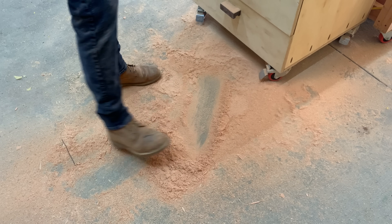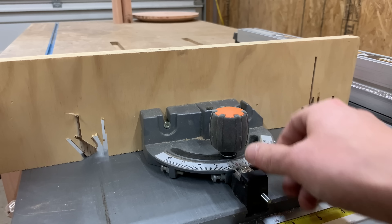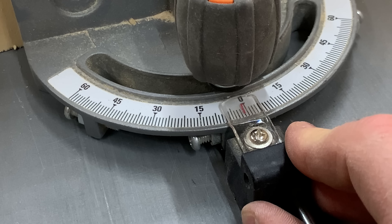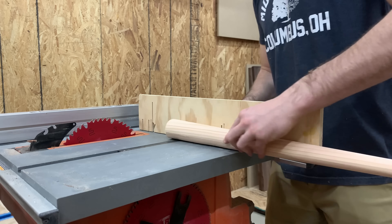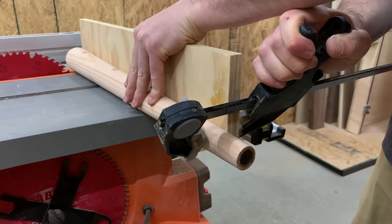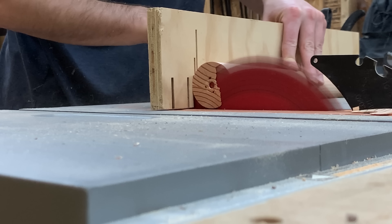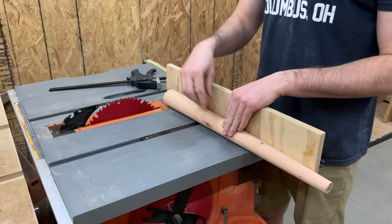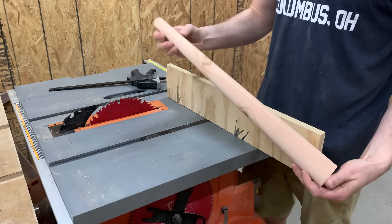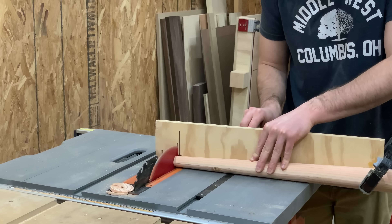I think I forgot to mention that turning legs like this makes an absolute mess. With the legs turned, I grabbed the stock miter gauge and set the angle to about 5 degrees. I'll be making a 5-degree cut on the top and bottom of each leg so that they can fan out — and that's sophisticated. What's not sophisticated is having the leg fly into your face, so I clamped it down to the auxiliary fence on the miter gauge. Once the miter was cut on one end, I flipped the leg 180 degrees, clamped it back down, and cut the angle on the bottom of the leg too.